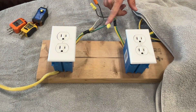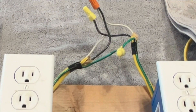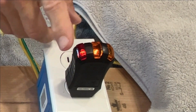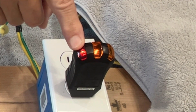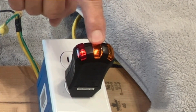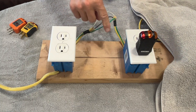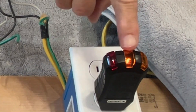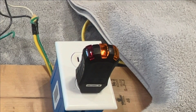I've reconnected the ground wires but now we've got black to white and white to black, so we've got a reverse polarity situation. The red light comes on to indicate that there's 120 volts between the neutral and the ground prong, and the center light comes on to tell us there's 120 volts between the neutral and the hot. But what happens if we disconnect the ground wire? We get only the center light, and according to the legend that just shows an open ground — it tells us nothing about having a reverse polarity.